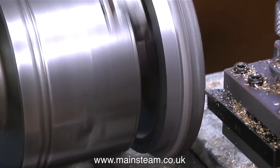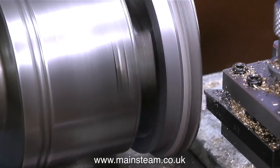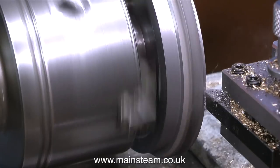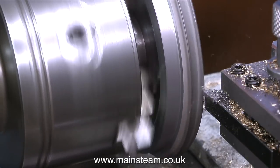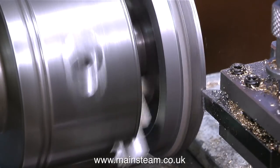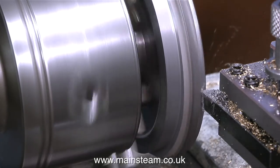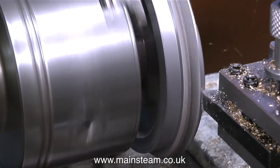So now I can take the wheel out of the large lathe. This clip shows the flywheel fitted into the three-jaw chuck of my small Boxford lathe. With the back gear engaged to slow down the lathe spindle and the speed of rotation of the work, I'm taking a rough cut to get through the outer skin of the cast iron. The Boxford has no problem taking cuts of this depth — the tool is a carbide-tipped tool so it's not going to blunt too easily, and it's cutting fine.